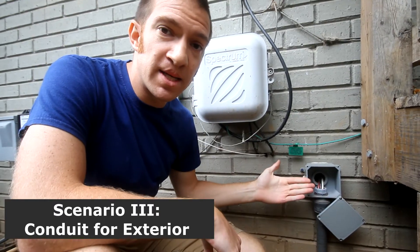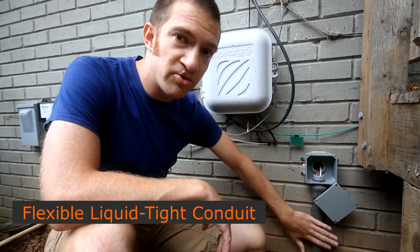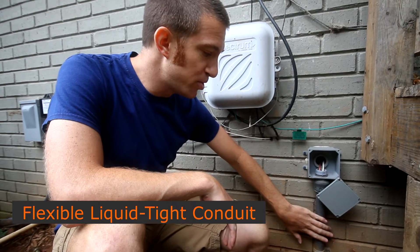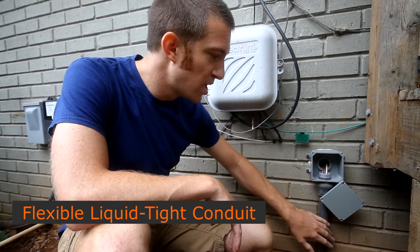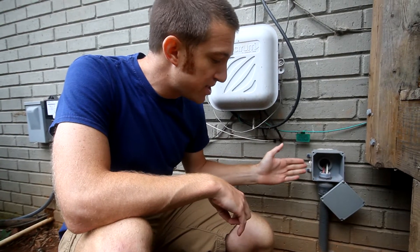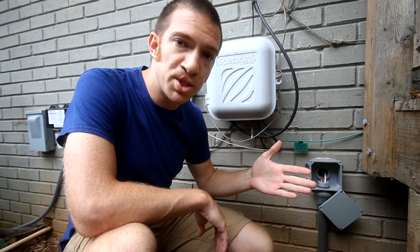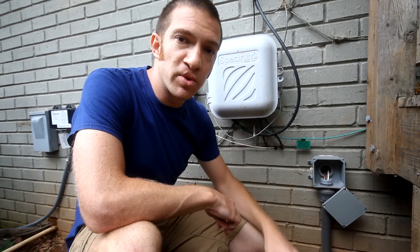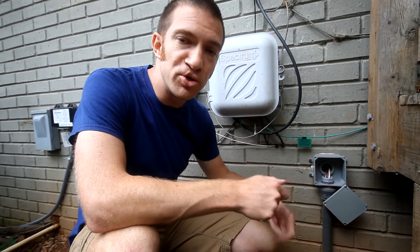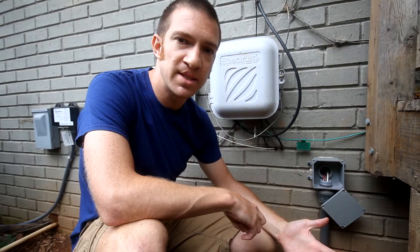For example, when we were installing electricity in our shed, we used an exterior liquid watertight flexible conduit, which is UV resistant and waterproof. We filled it with THHN-type wires. We chose flexible conduit because we wanted to make some gentle bends — rigid conduit would work just as well, but you'd have to glue each seam. I don't recommend metallic conduit as a homeowner because the tools are expensive and a pain to use.